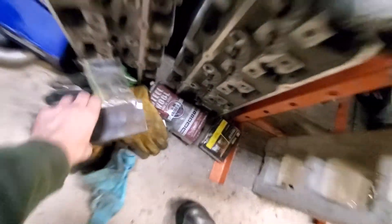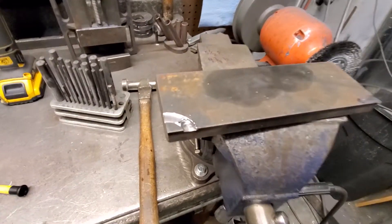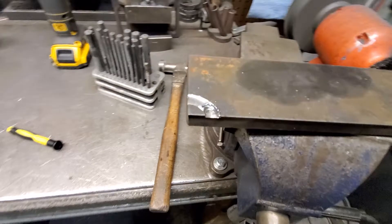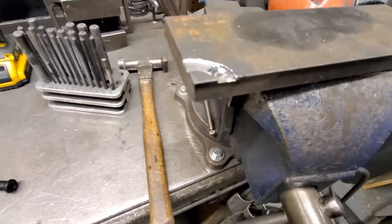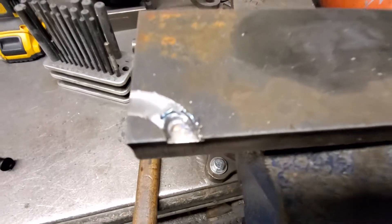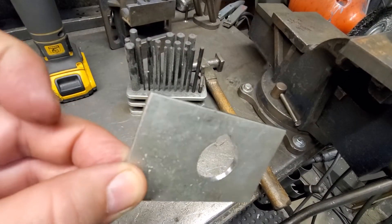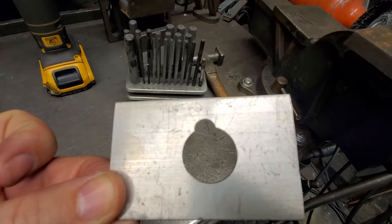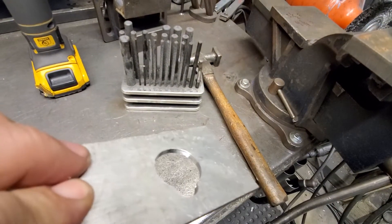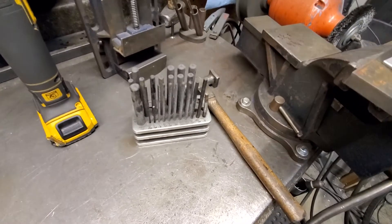I'm going to show you the things I've machined so far, and my failure. Got to really watch the feeds and speeds that Fusion 360 is giving me. This was a half-inch end mill, four flute, in mild steel — it came in on the first pass pretty decent, but then all of a sudden it just — this is my first actual good part. Aluminum's a lot more forgiving for any mistakes, like for the plunging rate.